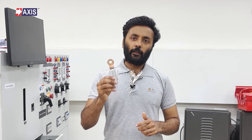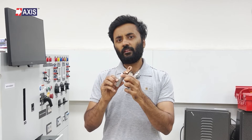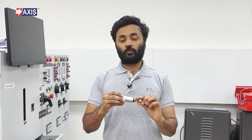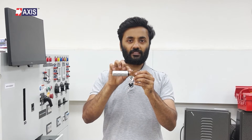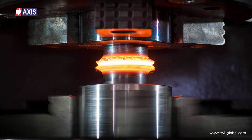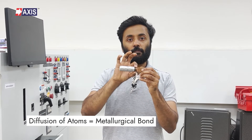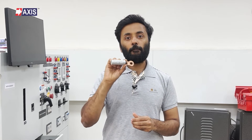But you might be thinking — why don't these bimetallic lugs develop dissimilar metal corrosion right at the junction, since two distinct metals are still coming into contact? The answer is friction welding. Here, the two metallic surfaces are joined by generating heat through friction. The parts being joined are held under high compressive loads, leading to the diffusion of atoms across the surface, resulting in a metallurgical bond between the materials. This bond eliminates dissimilar metal corrosion.